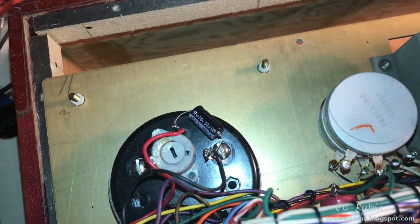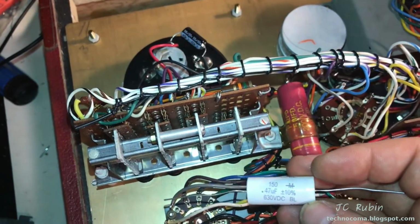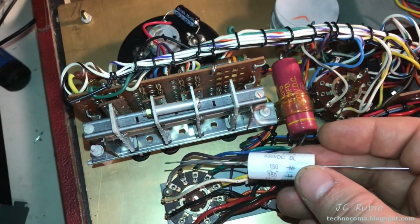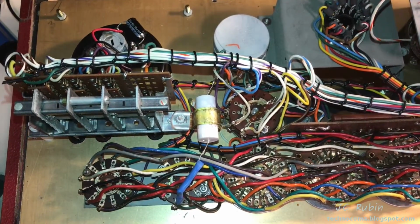I've got the first capacitor replaced, that's done. I started testing the other one. I could see no outer foil difference on this cap, regardless of which side I flip to ground. I see the same amount of noise, so I'm just going to put it in and not worry about it. Now I've got the second cap replaced too.